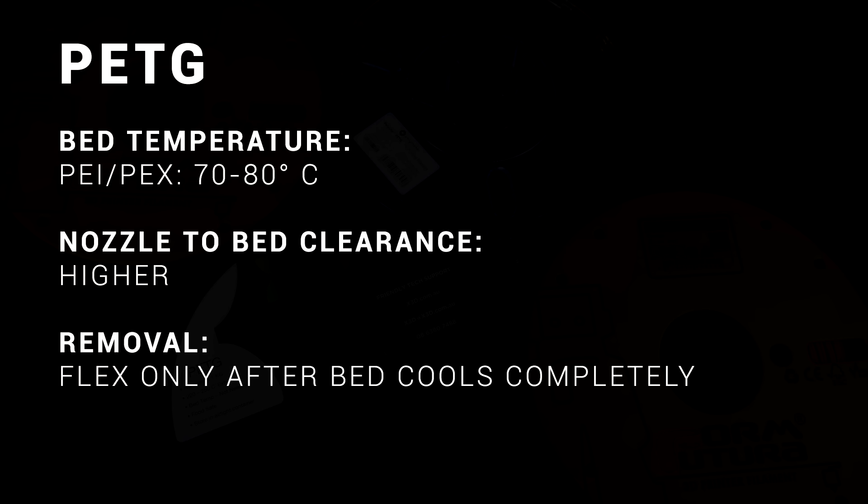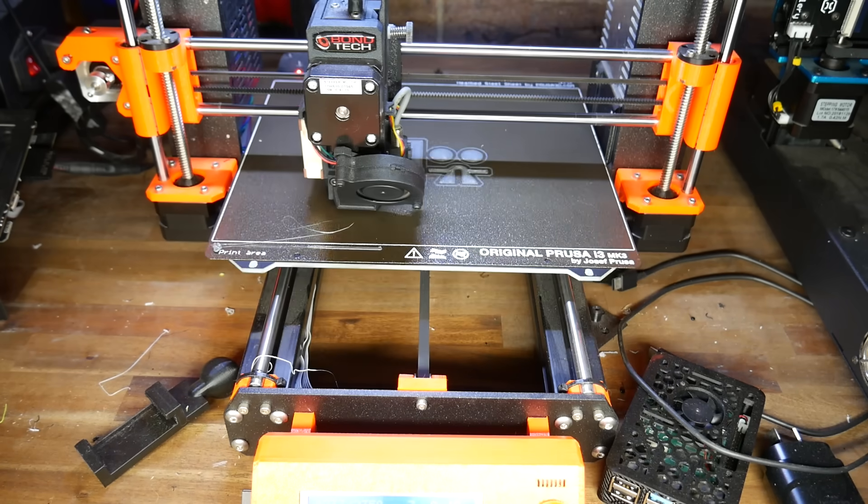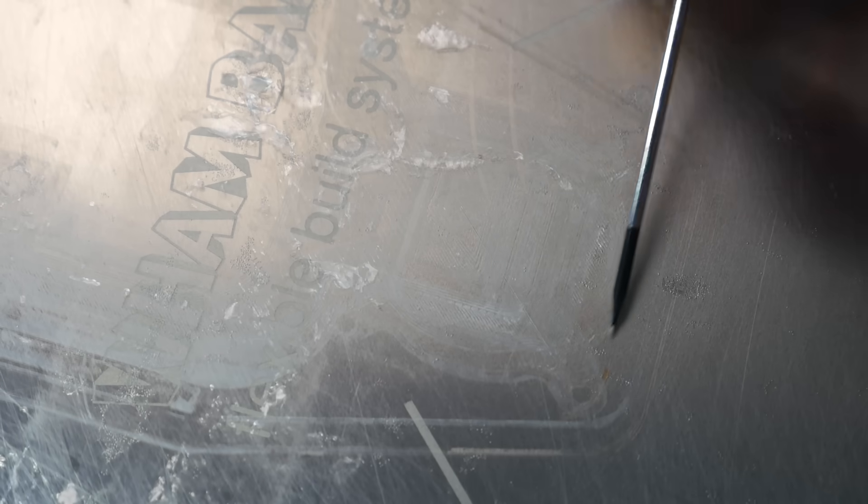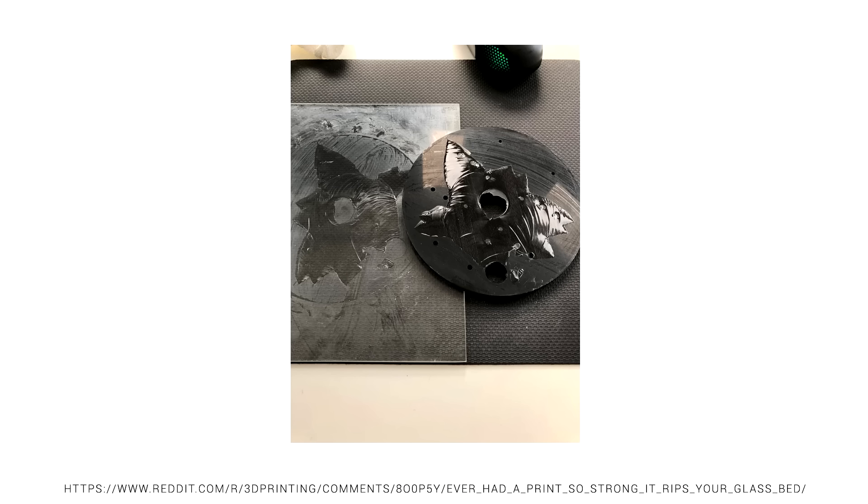We're moving from the right amount of squish towards the nozzle being too far — as the filament grips so well, it's better to have slight gaps in your first layer than risk ripping chunks of your PEI powder coating or sticker sheet. Only try to remove your parts after the bed has cooled down as much as possible. I'm using a Prusa PEI powder-coated sheet for my permanent PETG printer. After many dozens of prints, I've noticed some light visual deterioration, but performance remains the same.